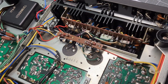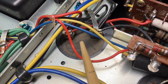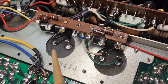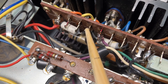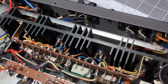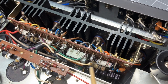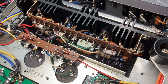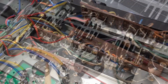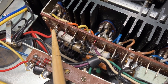This is the bottom side. What I'm seeing is the main power cap right here — I don't think this cap has ever been tampered with. I believe this is all factory soldered, as well as our main coupling caps. But over here somebody has desoldered these wires before and had this whole module out. The direction I'm going to go is I'll either desolder or snip these wires so we can get the module out, start making a parts list, and order our large cans and this really big one for the power. The sound is pretty good out of the left channel, but the right channel is extremely weak.